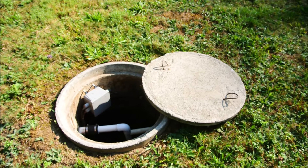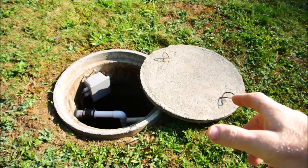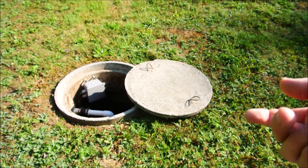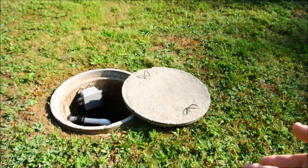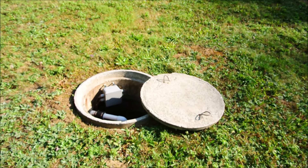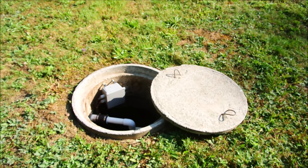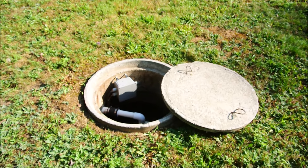There's a basis in reality for his opinion. The idea is that a septic is a controlled environment where there's a bacterial culture, and it helps to break down the waste. The problem is, you don't really know what's in a groundhog's bacterial mass — it's an extra variable. The system is designed to work without your help. It's folk wisdom to throw in baker's yeast or whatever you heard will help. It doesn't need your help; what it needs from you is periodic maintenance.